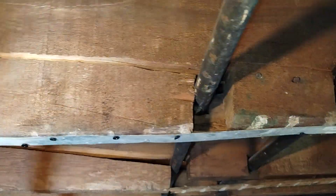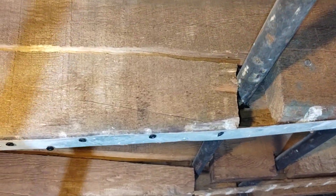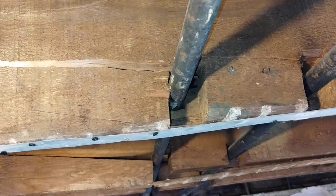As you can see, the left side is down and the right side is kind of flat and level over to the wall. The left side is taking a pitch down towards the center and there's a fracture in it. I've had a couple of contractors on this job tell me to just put wood back there – but that does nothing. It's the same exact stress inside the wood. You're just moving it out to your new piece of lumber, and if that lumber is grained such that the grain runs that way, it would split pretty easily.